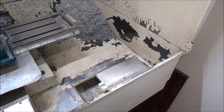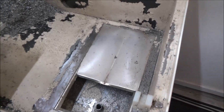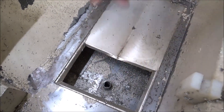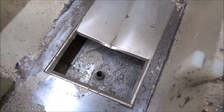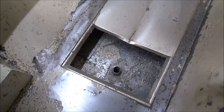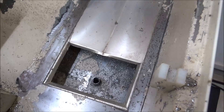Now that we've got our new enclosure patch pan, I need to remove the tray that I currently have and get rid of some of these little modifications that didn't quite work. I put this in here just to contain most of the liquid, but there's caulk in here and it just doesn't seal it up. So I'm going to remove all this stuff, pull this tray out, get rid of this little drip edge modification, and then clean all this up so I can put the patch pan up underneath and weld it up.